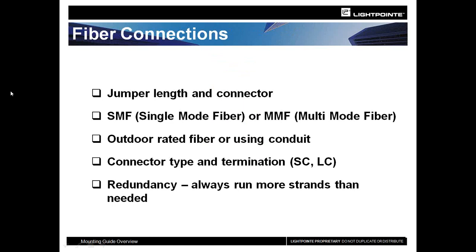We offer the option on many products to use fiber instead of copper. On our air product categories, we have two ports: an SFP port for fiber and a 10/100/1000 copper port. If your distance exceeds the IEEE standard for copper, fiber is available. Make sure you're running the right kind of fiber — single mode or multi-mode — and if it's outdoors, use the proper outdoor fiber or conduit. Our air-based products use LC connectors at the unit end; older Flight Strata products use SC connectors.